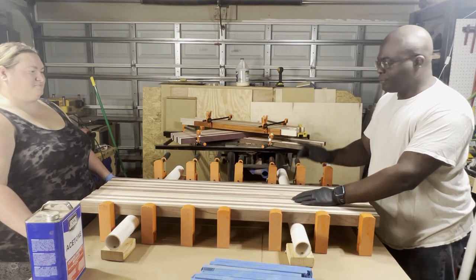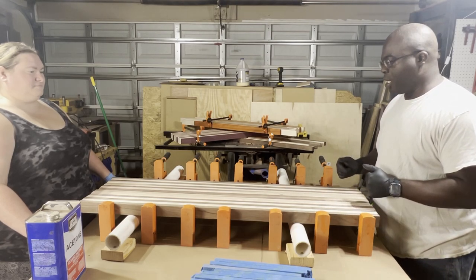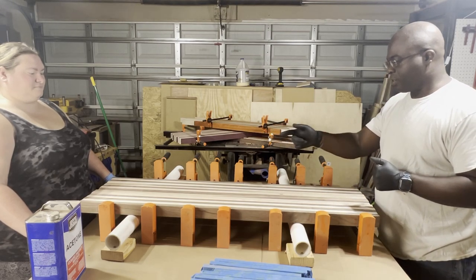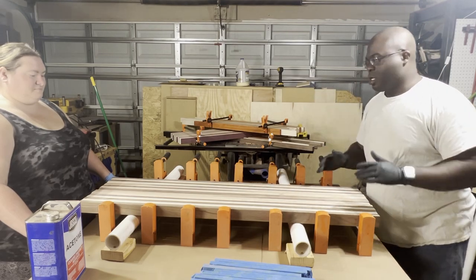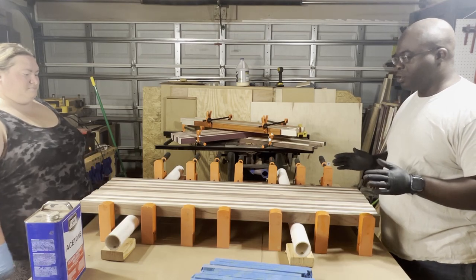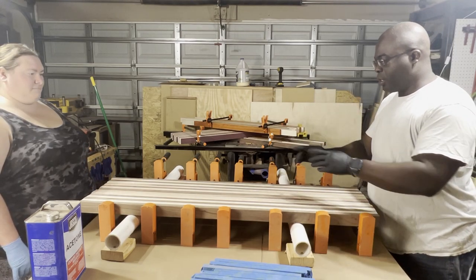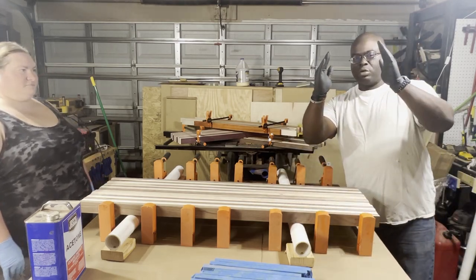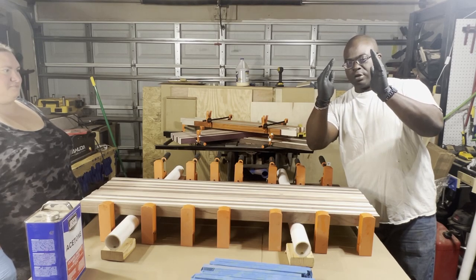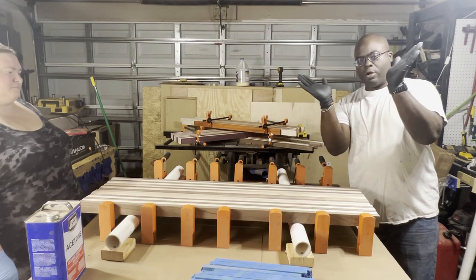First, number one is I like to stand at the end of the set of boards and look down them to see if there's any bowing, kind of like this or like this. Sometimes it happens when you cut in the strips. It's okay, it's no big issue. But what we want to do is make sure, as we're looking down the board, the bow goes like this towards the center, as opposed to like this, going outwards.